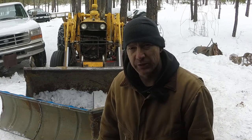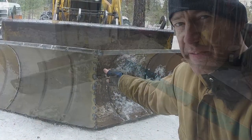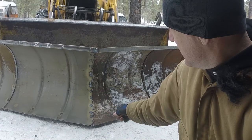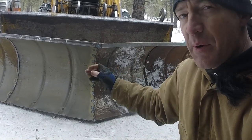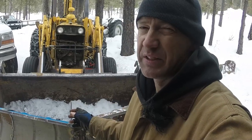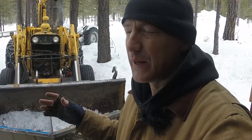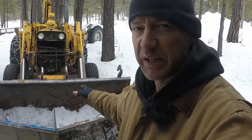I'll get you a closer look at what I've got. I took the two sets of barrels, propped the ends up on a log, and cut the V angle so I could weld them together. I made sure to leave a little bit in the middle as an overlap so I'd have an overlap of metal with two welds — making it a little bit stronger. Overall width of this V-plow as it sits right now is nine foot ten inches — almost ten foot, just two inches short. I think that might be a little too wide, but I'm not sure.